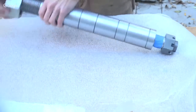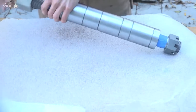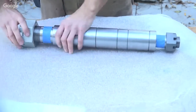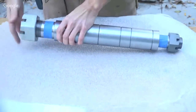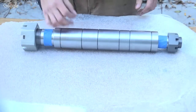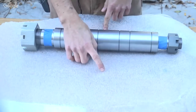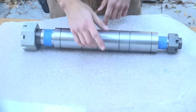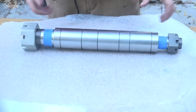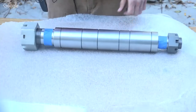Three bearings, not two — well, why not? My thought was why not add another bearing in the middle just to help stiffen the shaft and keep it from deflecting. Probably unnecessary, but the bearings are like $40 so I figured why not add another one. Plus it gives two more points of mounting contact to the plate, which should help stiffen the mounting as the tension from the blade tries to twist the shaft on the mounting plate.